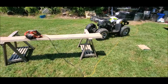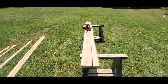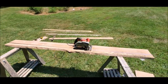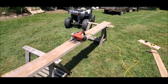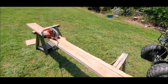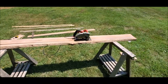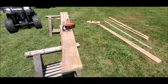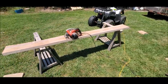Here I'm shaping two boards that are going to make the middle stringer. The two outside pieces will make more sense once I take you half a mile into the woods and show you the bridge. It's a 12-foot span — I have two 12-foot six-by-sixes for the main structural beams, but I didn't have anything that long for the middle, so I'm taking lumber I milled with my chainsaw and I'm going to sister them together.